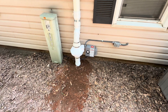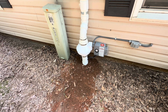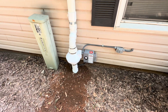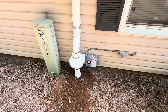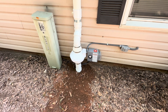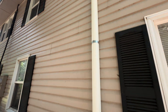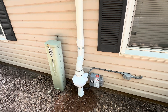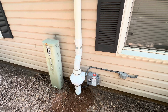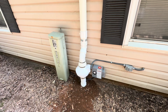This is the backside system after cleanup. We replaced all the piping — they had three-inch pipe going in at a weird angle, which forced a closet 90 and some 22s, and there's a lot of airflow in the system. It's a pretty leaky system, and unfortunately we can't access the tub shower — it's inaccessible. So we oversized the hole to four inches from three, replaced all the 2x3 gutter with four-inch diameter pipe, and we're moving a lot more air now — much more efficient. We're now getting a pressure differential across the slab. Originally we had about 0.8 Pascals of suction; we've brought that up to 6.8 Pascals. She's good to go — I think we're going to get the radon down in this apartment.